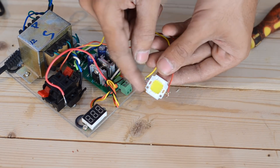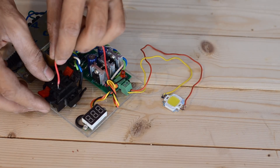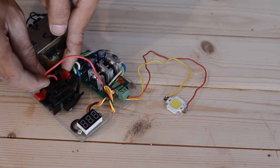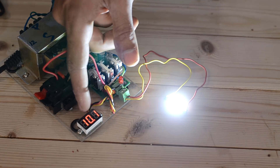To test this power supply I've used a powerful LED light that can draw up to 2 amps at 12 volt. The output voltages seem to be pretty consistent, except the 12 volt output that drops down to 10 volts due to the limitations of power delivered by the transformer. This can easily be resolved by using a more powerful transformer, and this thing can serve as a basic lab bench power supply. I hope you liked this video and understood the basic principles behind converting AC into DC voltages. If you like this video, don't forget to give it a thumbs up, check out some of my other project videos, and subscribe to the YouTube channel. Thank you very much for watching and I'll see you soon in the next one.